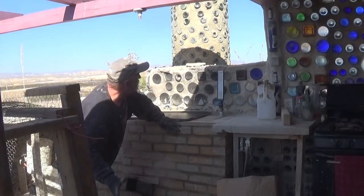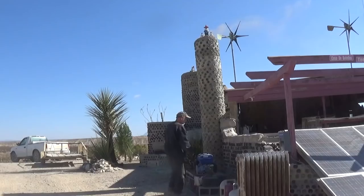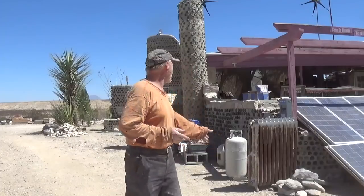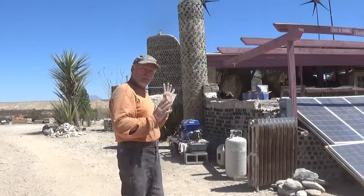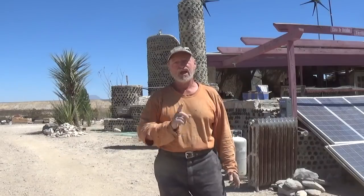So we did the brick face in the front — that's your thermal mass. It holds the temperature in. There's the cooktop, my feed. Down here is the ash drawer just like I showed you. And we finished the chimney. Perhaps the most fun I've had with this whole project — making something new and having it work was really cool for me. The most fun I had was doing the chimney. I showed you how it was a slip form and I just pulled it up. It looks like it's not level in pictures, but if you put a level on it, it's completely level all the way around. It goes up about 12 feet. And then like what I've done with my other chimneys, there's a special treat at the very top of it.